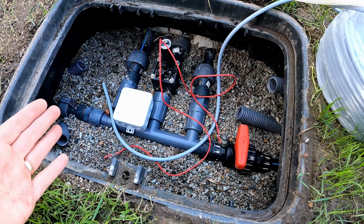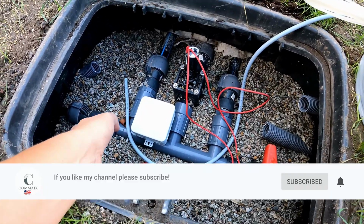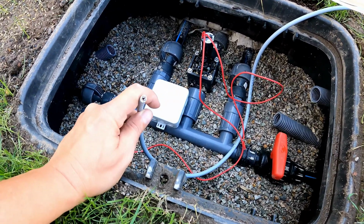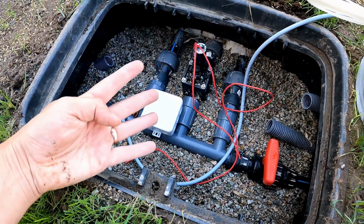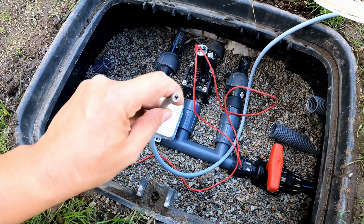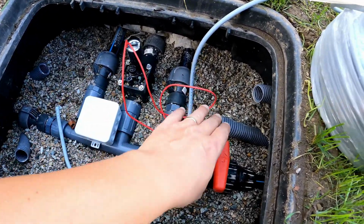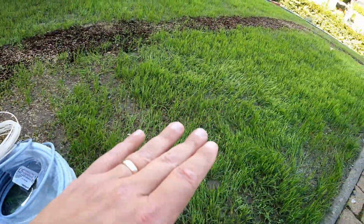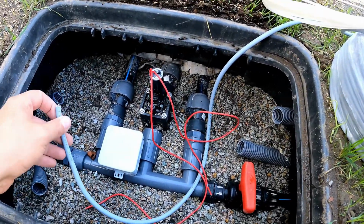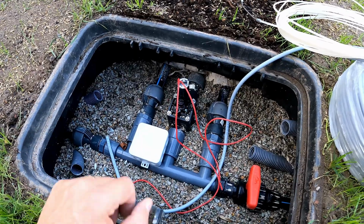Speaking of connections, my goal is to pull a cable through the empty conduit to my irrigation controller. This cable with 5 wires gives me the option to connect up to 4 valves in total. Currently I only have one valve, so I have the possibility to control 3 more valves using this cable. I'll run the cables from the other valves from the Gabion slope or the raised beds to here. Then I'll connect the cable from the control computer to these new control cables. So I'm basically building a distribution station for the control cables.